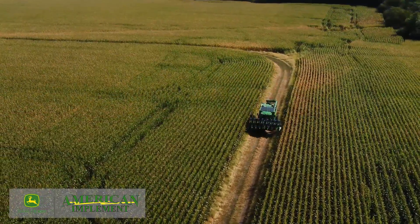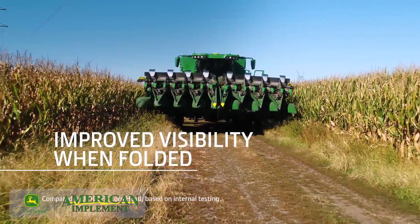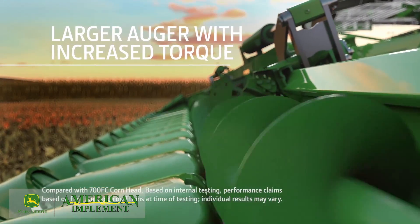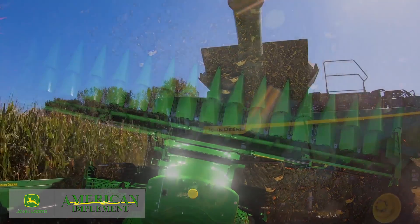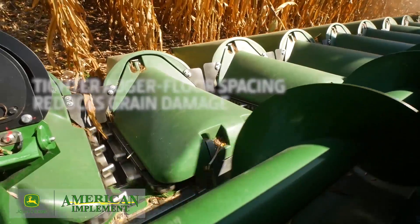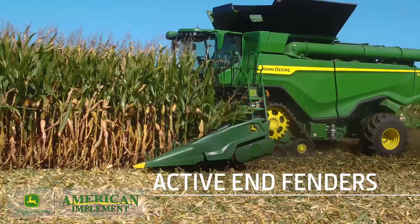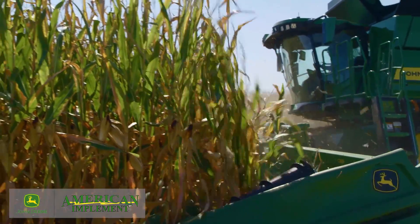That'll help you move quickly between fields during harvest. We improved visibility when the head is in the folded position — the head sits 12 inches lower, resulting in about 8 feet of better visibility compared to our 700 FC. A larger 19-inch auger with increased torque helps you cover more acres per hour and ensures you are not limited by the corn head feeding rate, even with a larger S or X-Series combine in tough conditions such as high-moisture corn. The auger has a smaller and more consistent gap between auger flighting and floor to reduce the pinching of kernels. Active end fenders are available to help you harvest in down or leaning corn, reducing the chance of ears being tossed over the side of the head.